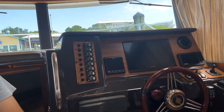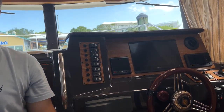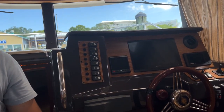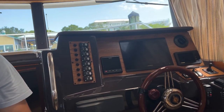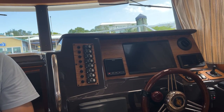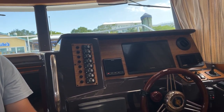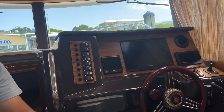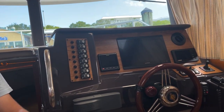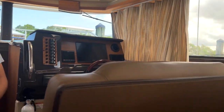Okay. Next section is AC electrical. Do you have questions about connecting the shore power plug? No, I mean, I'm familiar with the basics. Okay. These shore power plugs, well, just like any 30 amp, you want to make sure that you connected. It only goes in one way. Yeah, you push it in, you want to twist it to the right. And you don't want to cross thread that stuff on the boat, so sometimes you want to go backwards to sit it in the right place and then tighten it. You know, because it's all plastic, so. But let's keep on going back.